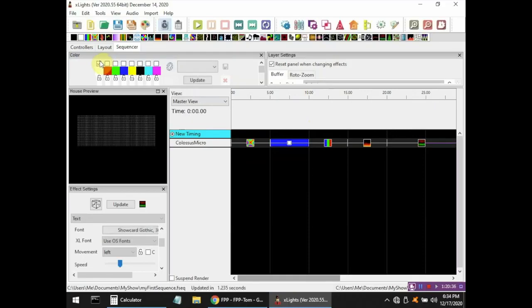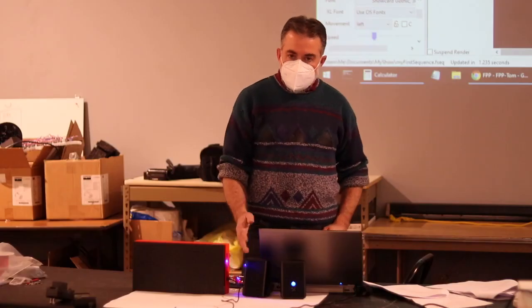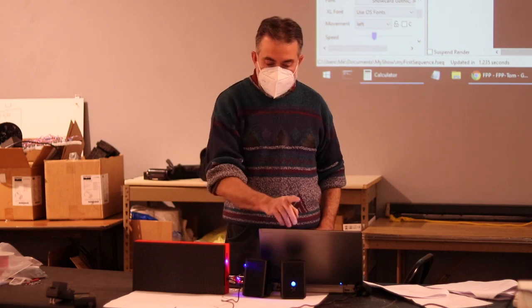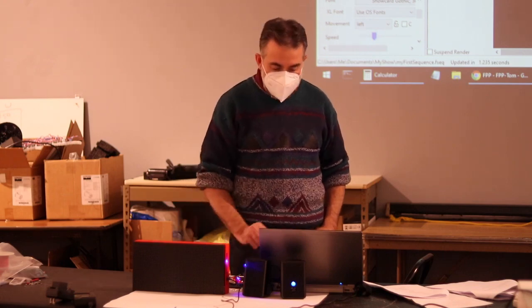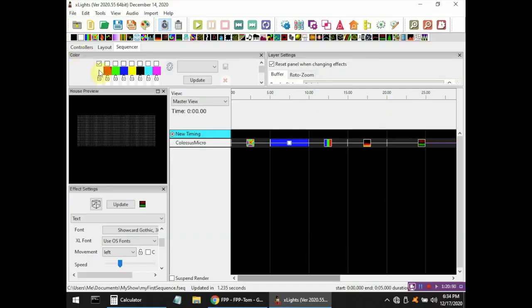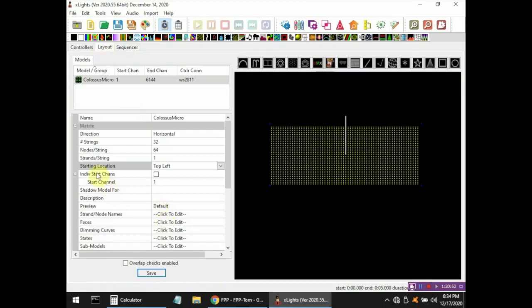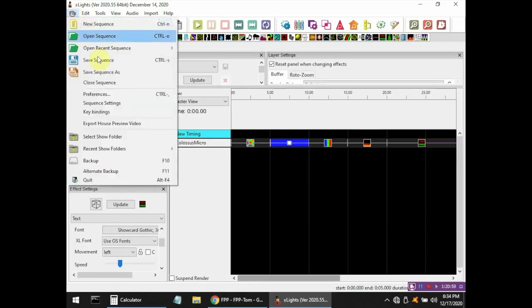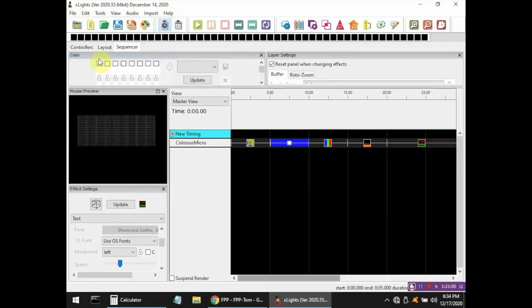Okay? And then the files on the hard drive, those animation files, now have the correct starting location. But they're not uploaded into this yet. So we have to recopy it from the hard drive back onto the display. So again, I corrected, I went to Layout, I picked a different starting location, for a different corner here. I went to the Sequencer tab and I resaved my sequence. Just hit Save Sequence. So it generates a fresh animation file.